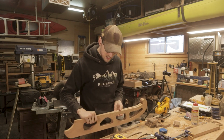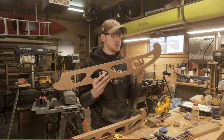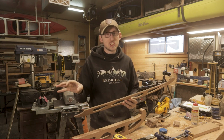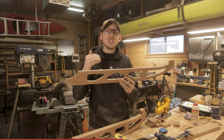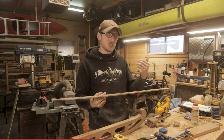So this is definitely something that I need to get into more with the projects that I've been working on, even some of the furniture stuff. Making just a simple template out of some cheap hardboard is a really good way to work, because if your pieces are anything but perfectly square, you have arches, curves, anything like that, or you just have openings like are on this piece here, making sure that all of these are the exact same between all your different pieces with a simple template is just so easy, and especially with that compression bit.